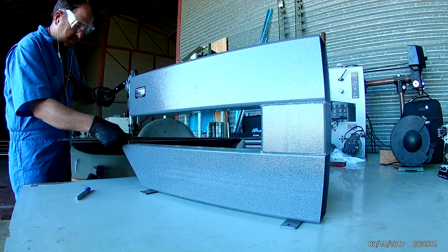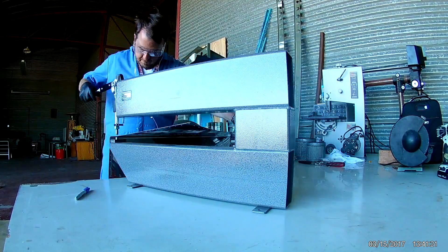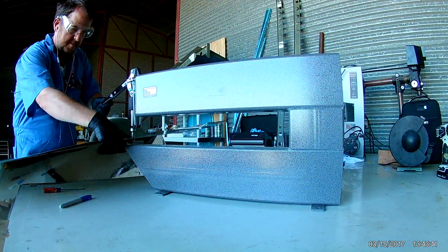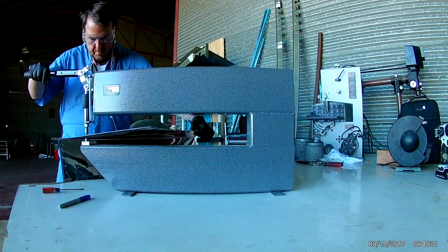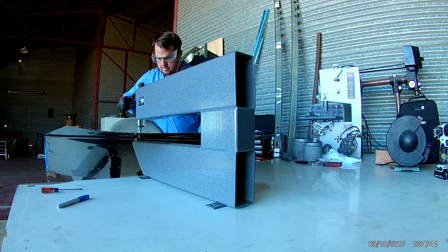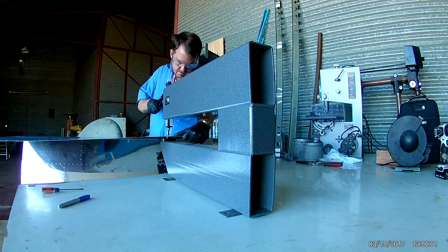Talking about making horrible mistakes — here I am dimpling the entire skin having not primed first. I'm using self-etching primer, which technically doesn't need the metal to be scuffed before it's shot onto the skin. However, light scuffing does help the adhesive qualities of the paint, especially on large flat pieces like skins, so I'm inclined to scuff whenever the piece is easy.